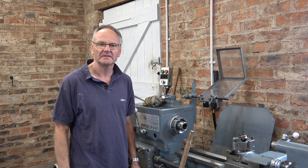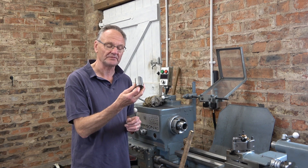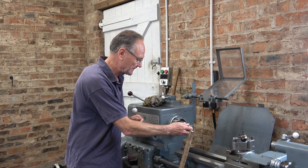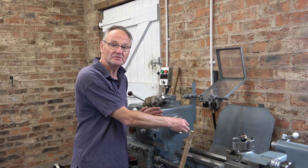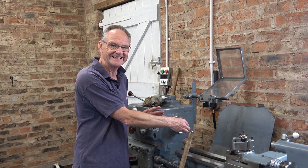Welcome to Haxby Shed. When I first got this spindle nose bush, which reduces from four and a half morse taper to three morse taper, it used to go in nicely and didn't used to stick too much. But since I've been using it, it's bedded in and starts to stick, and it's quite hard to get it out.